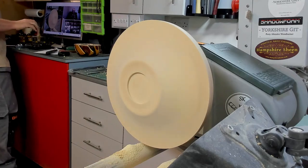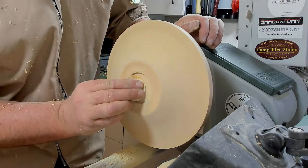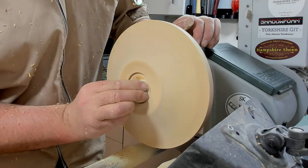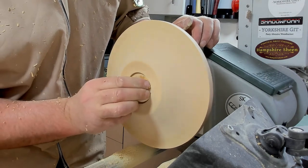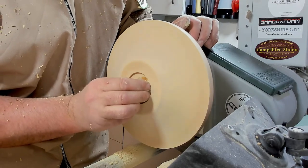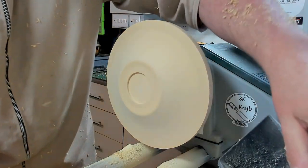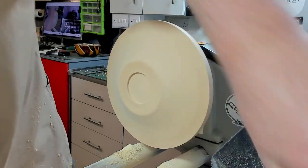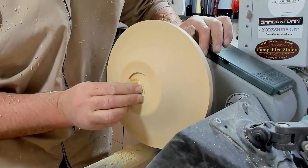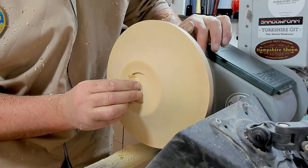Question regarding the dust extraction tube: when grains of dust rub together, they can build up a static electric charge. They can, Susie, through any plastic thing or even a steel tube. I get a shock off my vacuum cleaner occasionally. I run an earth wire down mine. If you catch it every 10 minutes, you just get a belt through to the lathe, and it's not a problem.